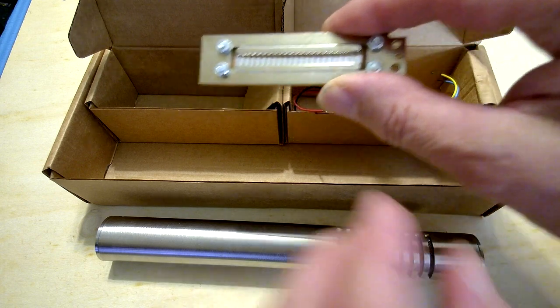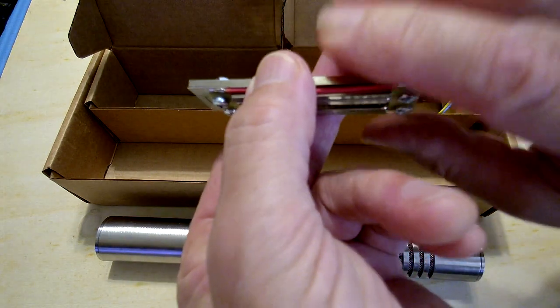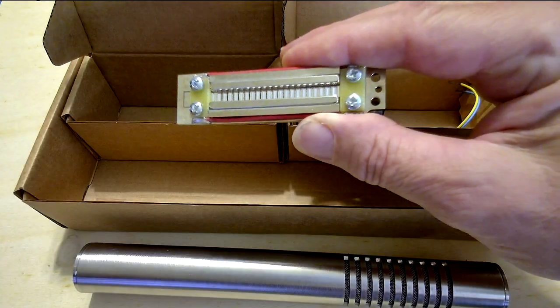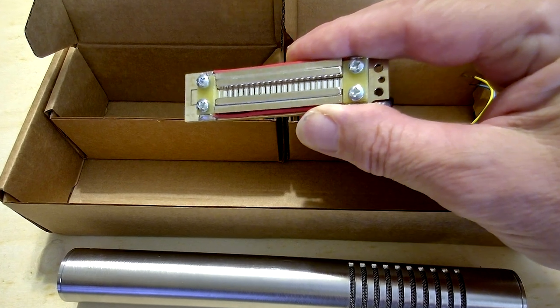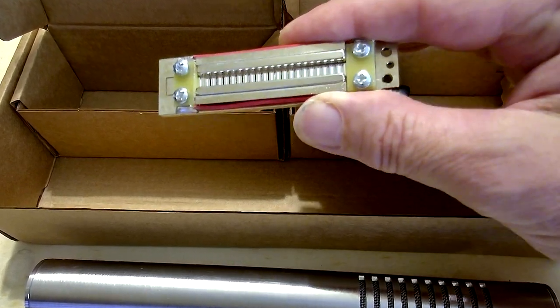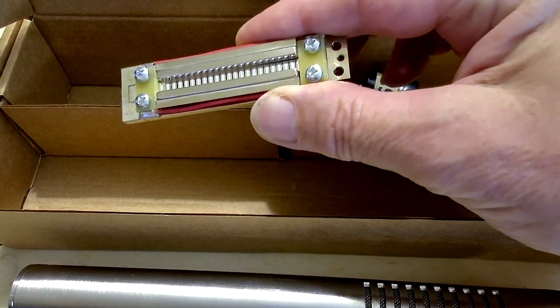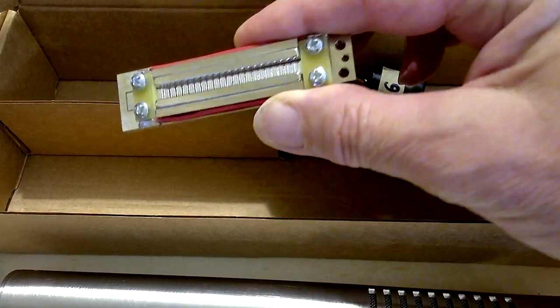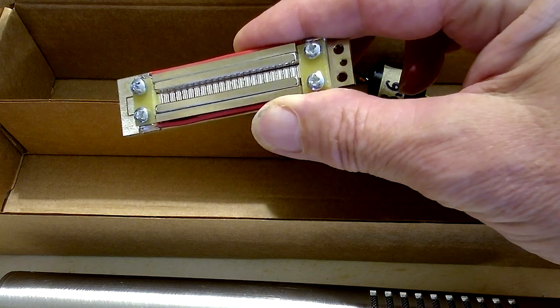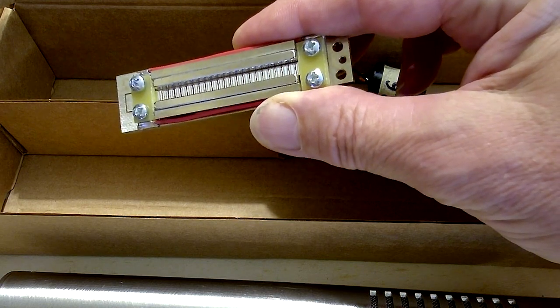Be sure to keep your work area clean and make sure you don't have any small metal parts like screws or tools near the ribbon motor while you're building this microphone. The magnets are very strong and there's a possibility that you could damage the ribbon if something were to be attracted to it. The foil of the ribbon is only 2.5 microns thick.